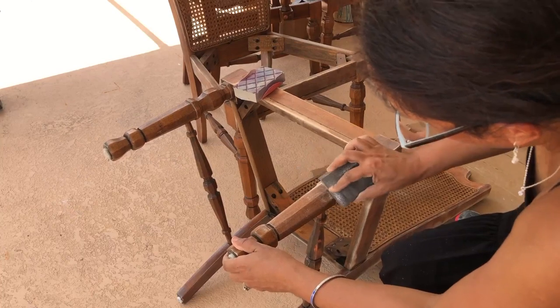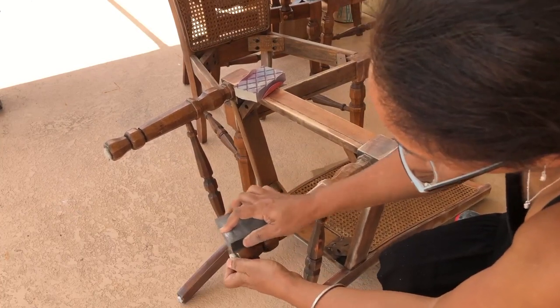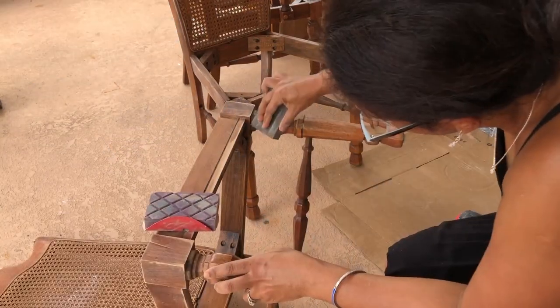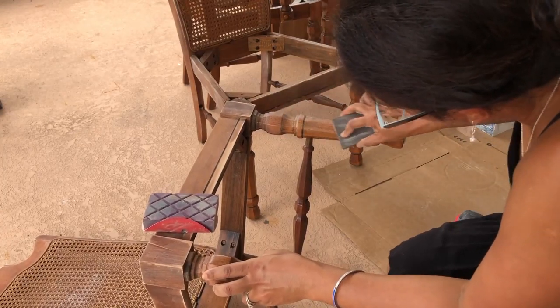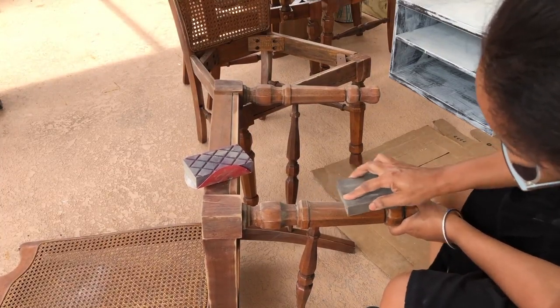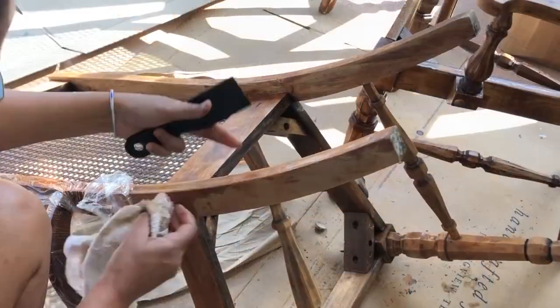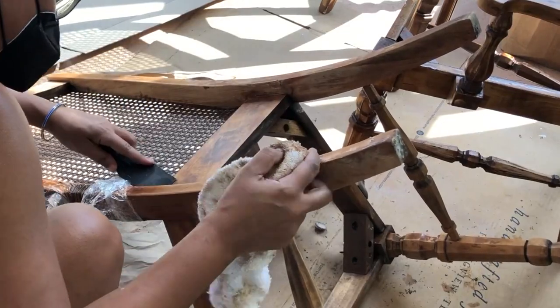Since I will be painting these chairs, I started by sanding the frames. Now, I'm doing this project in the middle of the summer and I live in South Florida, so this was a grind. As I sanded and sanded, I kept thinking, when will I ever finish? So I decided to speed things along by using a stripping gel to remove the varnish.